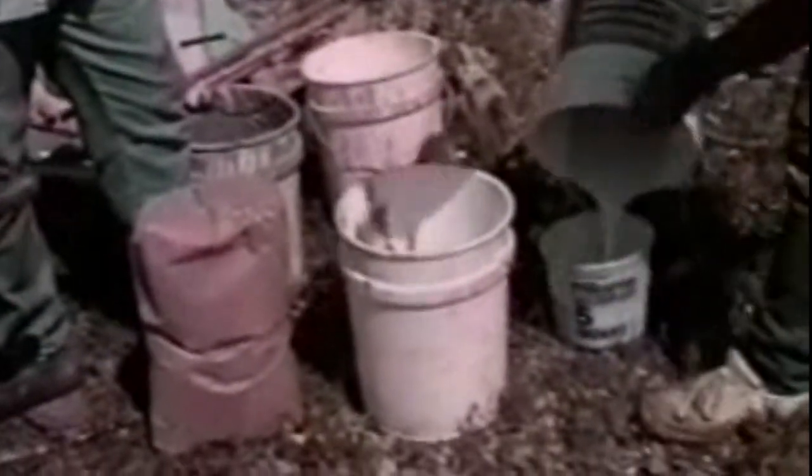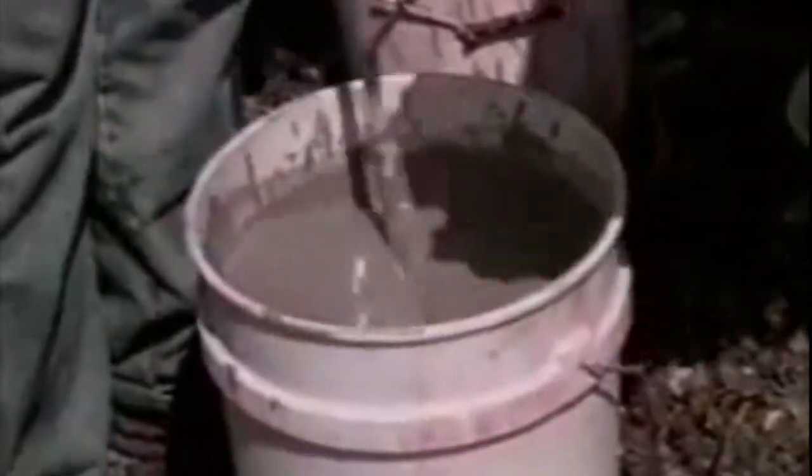In this area we're mixing material for the base coat, and over here the stamp mix is being prepared in a mortar mixer. Here you'll notice a departure from the normal concrete stamping process. The bag mixes are already pre-colored in a limitless selection of colors to ensure uniformity and color integrity, making interior applications possible with no ambient contamination.